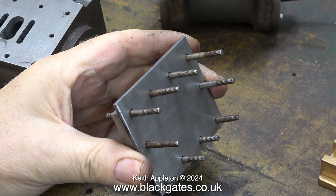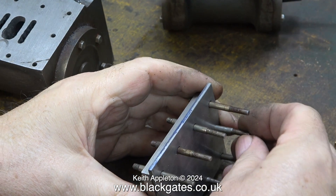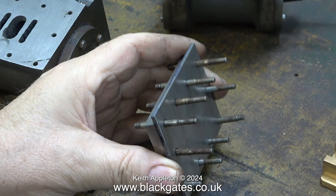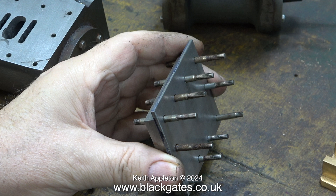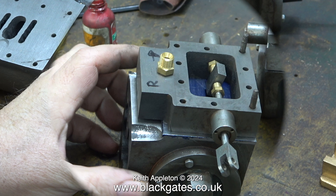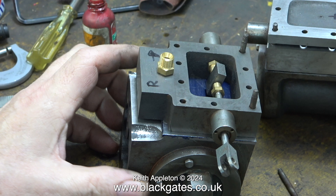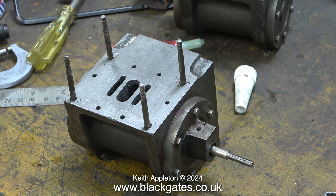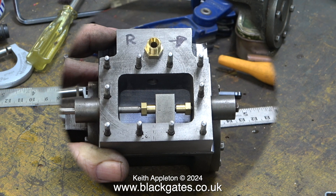The heat from the drilling operation separated the two plates so I didn't have to heat them up with a blowtorch — mainly because the Loctite 603 I used was very old and past its sell-by date. The good news is all the studs fit in the holes and as you can see the holes are slightly larger than the studs, but that is fine — I never wanted them to be tight. If the port face filling idea is not successful, I will be using these plates after I've milled the ports, physically sticking the metal plate onto the top of the cylinder using JB Weld. I could use a gasket but there's less chance of JB Weld blowing when in service. I could also use high temperature silicone but I'm not a big fan of silicone rubber sealant for live steam applications.